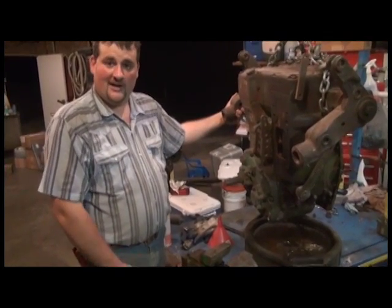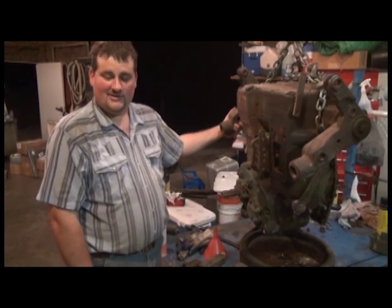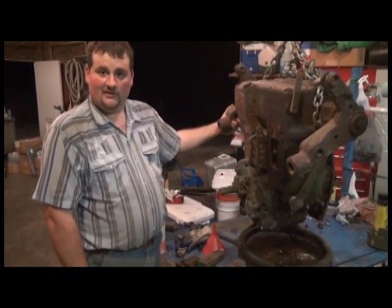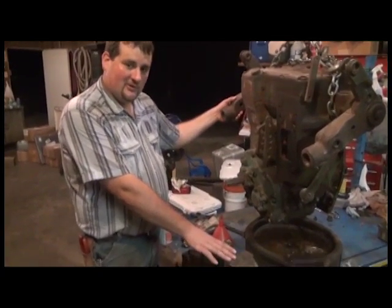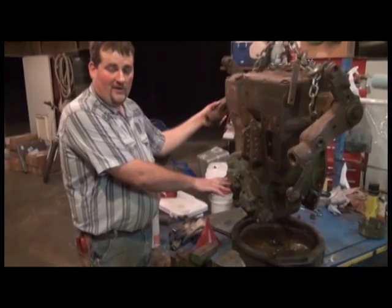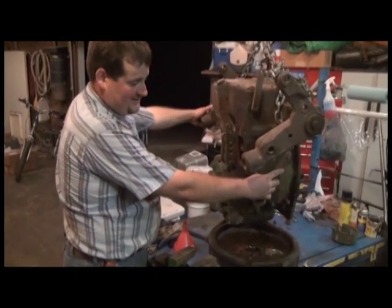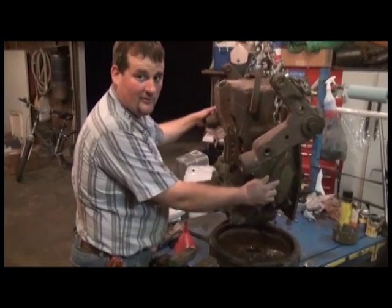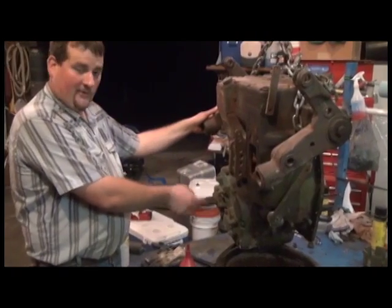This needs to be done with the tractor off, not running, and to re-engage the same way, because you're actually physically disengaging a set of straight cut gear. But as far as reasons why your clutch can be freewheeling, first thing is it could be just way far out of adjustment. Secondly, your linkage could be out of adjustment.